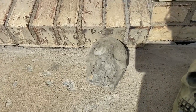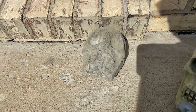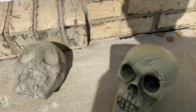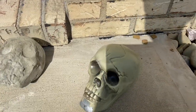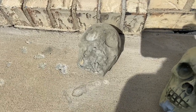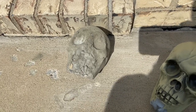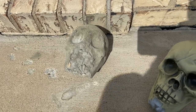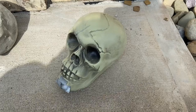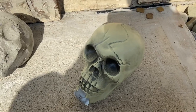We had a bit of a mix-up with this one — maybe the mix ratio or just my carelessness — but the teeth fell off and it basically exploded. We're going to let this one cure in the sun for a few more days. I took the first one out of the mold at maybe four days in; I figured 48 hours per the package plus another two days since it's sealed and not baking in the sun. This second one — today's day seven — we're going to figure it out.